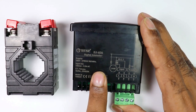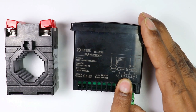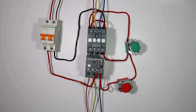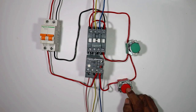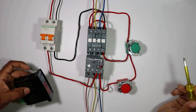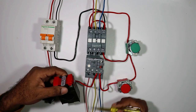Now this ammeter we have - full details of the ammeter are given here, and along with this how to do the connection of the ammeter is also shown in the diagram. I am going to explain this same diagram practically. This is our DOL starter through which we are turning on and off a three phase motor. In this starter we have to do the connection of the digital ammeter using CT, and right now we will learn to measure current for only one phase.